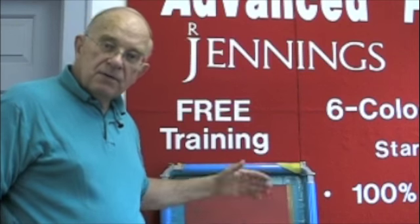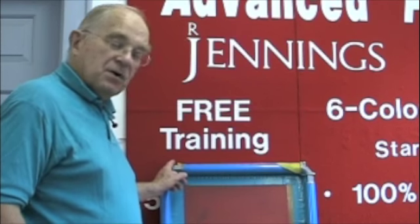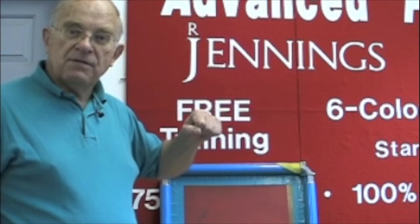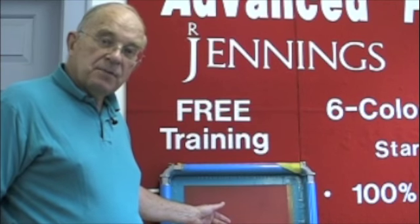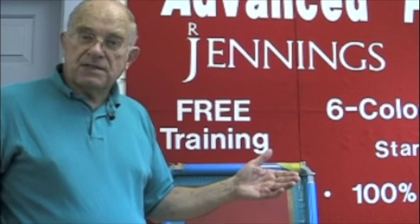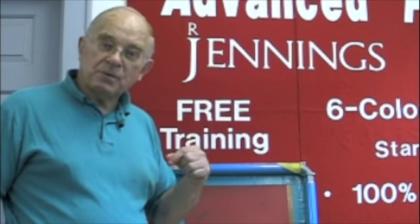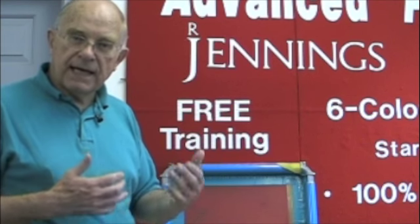Once the job is done and we've reclaimed the screen, before we put a second image on there, again we put our wrench on here, just takes a couple of seconds. Boom, recover that lost tension, raise the tension level, go to our next job. After we've accumulated 500 prints on this screen, it's what we call dimensionally stable or work hardened. That means the tension at the end of the job is the same as the tension at the beginning of the job, and we don't have those problems you saw on those jackets because the mesh is really tight.